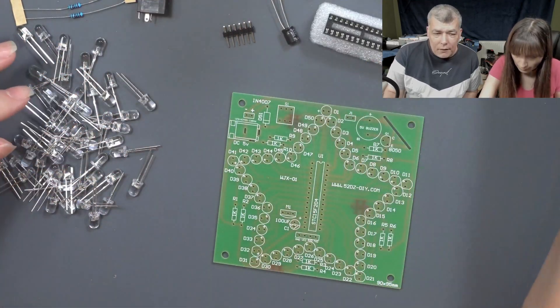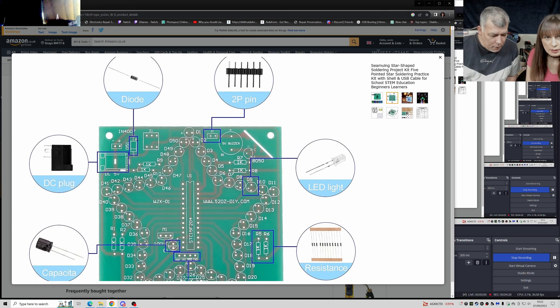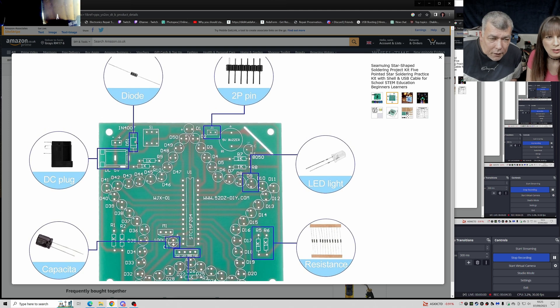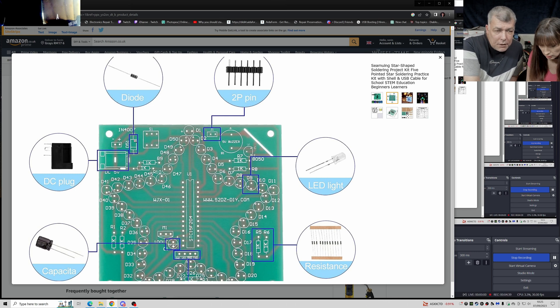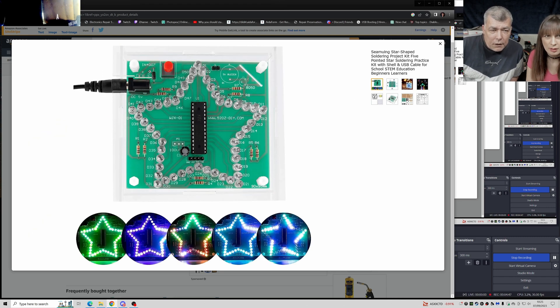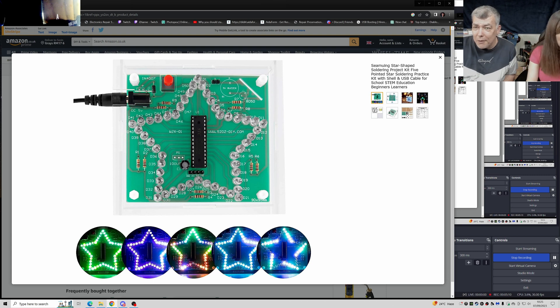According to the schematic, on the side you should have a diode — D51. Which one? This one. It's not there. Let me see what it's doing. It's a plus and minus. Maybe it's a wire or something? So that diode is missing. You don't need a diode — well, you do need a diode, but the diode is to prevent swapping plus or minus. So if you swap the polarity, the diode will protect it, but it will work without the diode — you just can't make mistakes.